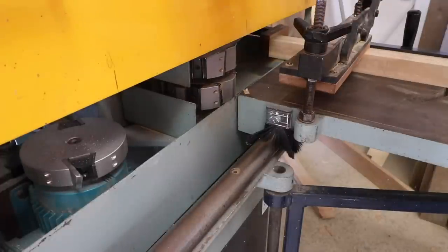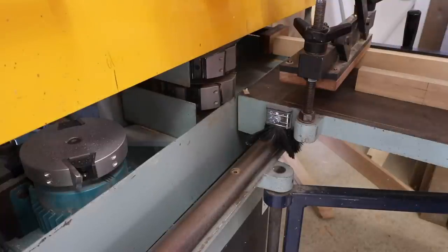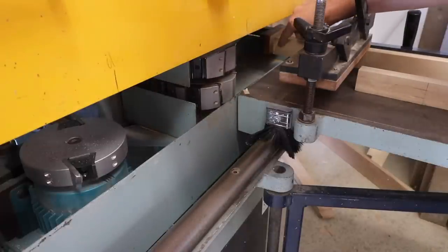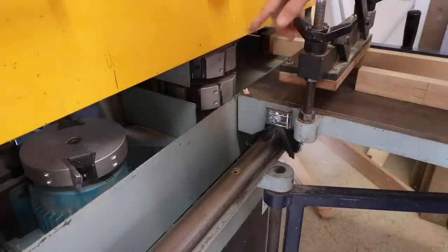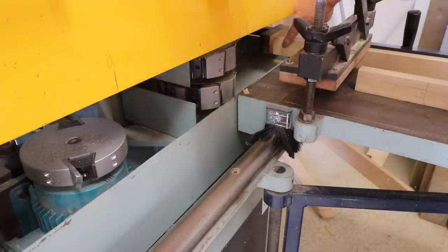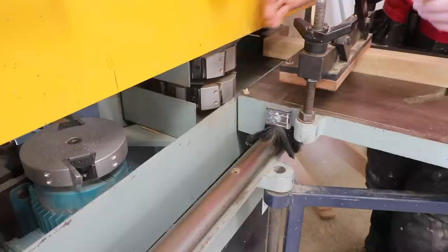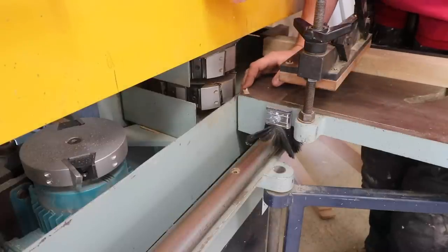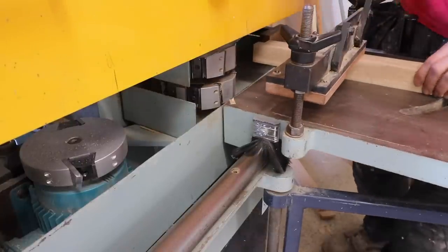When you do your very first cut, cutting the backing piece that you screw to the fence, you want to make sure that the cutters are back from where you potentially might need them. They don't want to be forward and then have to move them back to a cut. So you're going to have to reposition this to make sure that the cut is exactly in line with this piece of timber. If you don't reposition it and you've cut forward and then move the cutter block back from that position, you end up with a small portion of timber on each piece that you cut that's not supported by this backing piece, and will make it a rougher cut, so you'll get more breakout at that point. So always make sure that if you're aligning two cutter blocks, especially on the Sedgwick, the top head is slightly back before you do your first cut, and you move it forward into position.